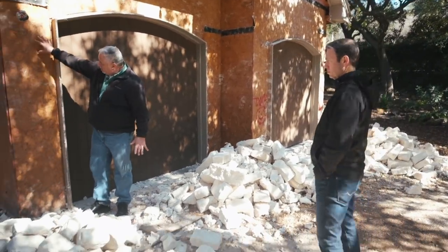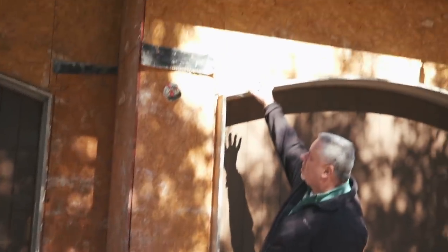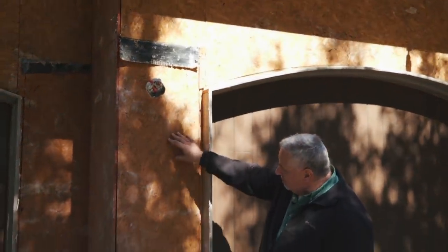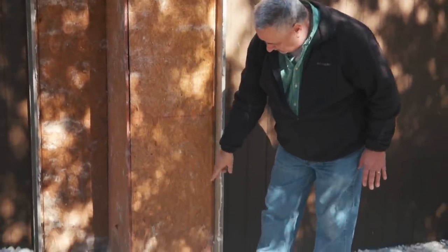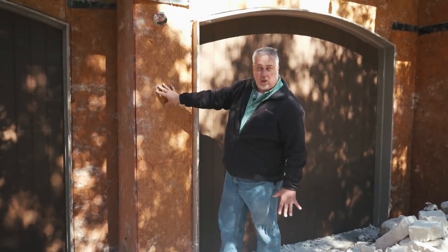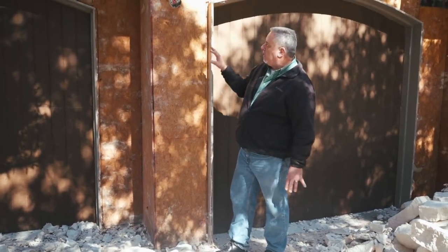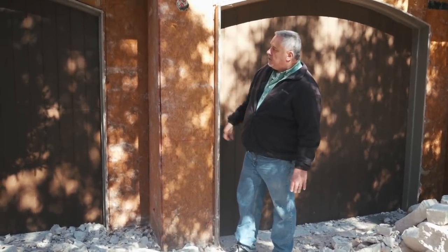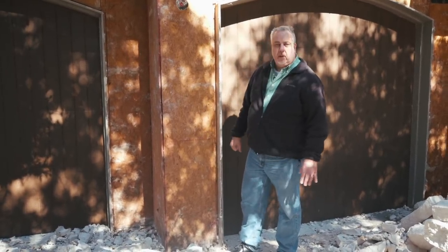It had a good umbrella over the building. When you look at a wall like this, it's pretty easy to see - up here, that OSB looks almost brand new, like the day it was installed. As you come down the wall, you can see it's wafering a little bit here and there. Then as you get down here, you can see where it's grayed out. So it gives you a quick understanding of: probably never saw water, saw a little bit of water, saw a lot of water. You get an understanding of how to flash the building and how you should be putting it back together.